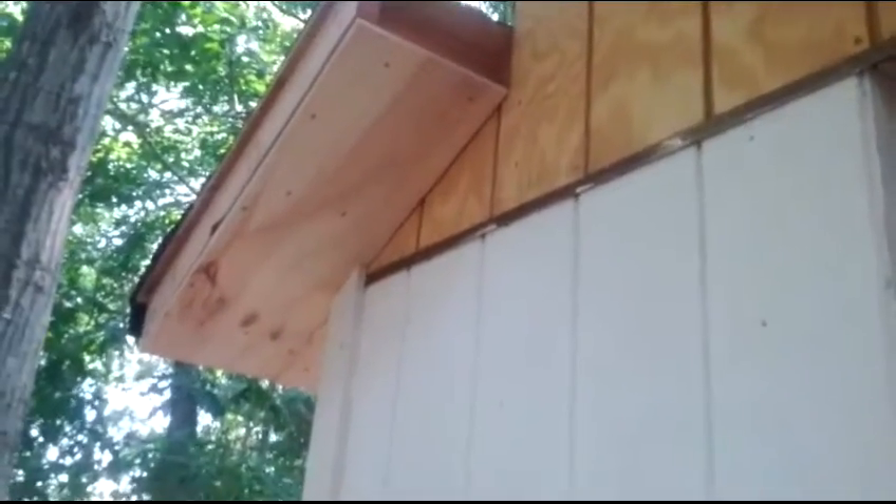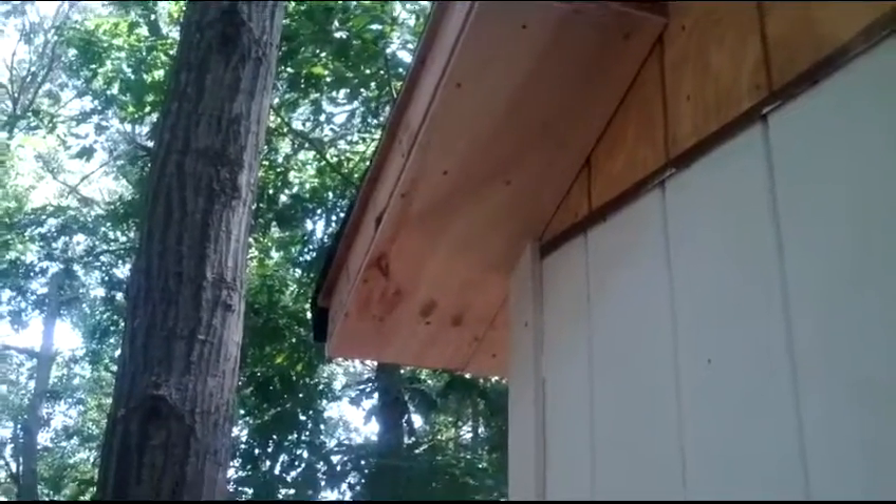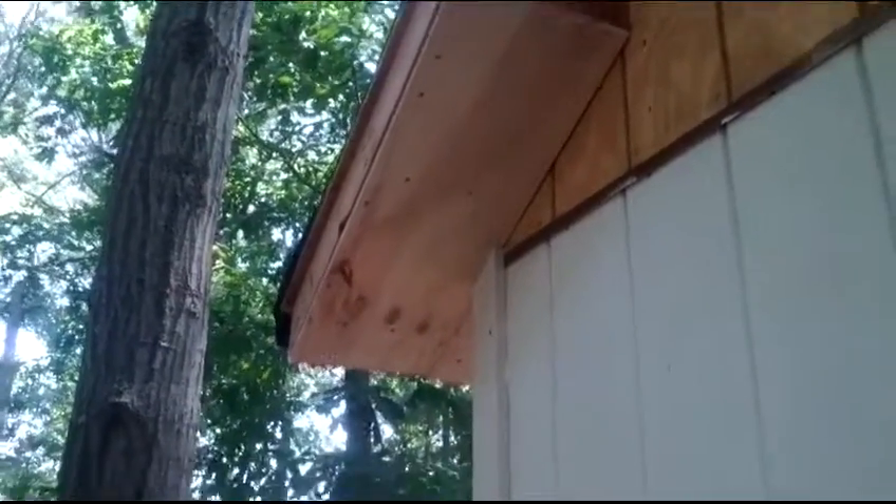So that's where we are with the corner boards. I think that'll be it for corner boards for right now because I've installed this soffit, which gave me something to bring the corner board against. I still have to install the soffit around the back, and to do that I actually need to put a deck on so I can better frame up here. But before I put the deck on I think I'm actually going to go buy the 1x6 so I can properly frame the fascia. I'm not doing it in any particular order.